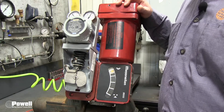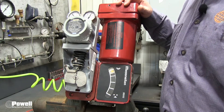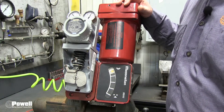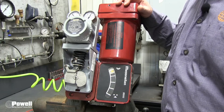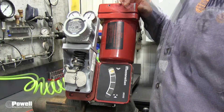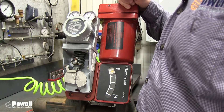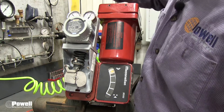If difficulties are encountered getting both positions correct, the zero position adjustment is the most critical. The 100% position is not as critical and the valve will still function properly if it is close but not exact. After adjustments are complete, tighten the locking screw on the spring and the locking nut on the zero nut as demonstrated here.